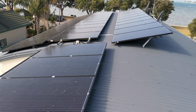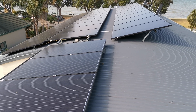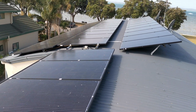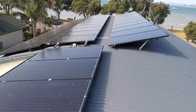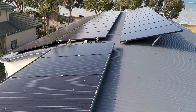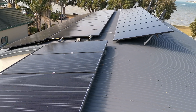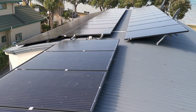It works very efficiently. It's not ideally north-facing, but it's hard to ever get it perfectly north-facing, so I think it's about getting the best direction on your roof that you can and elevating them as ideally as possible. In New Zealand the ideal elevation is about 25 degrees, but some of mine are about 15, some about 18, and some are even flatter — but they all seem to be working at about 85 percent.